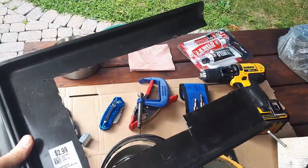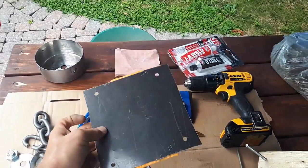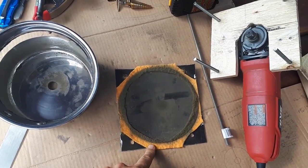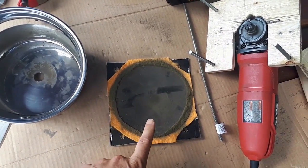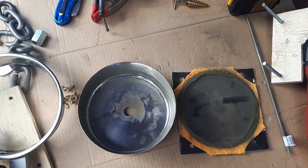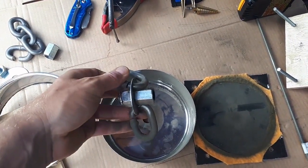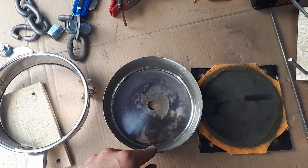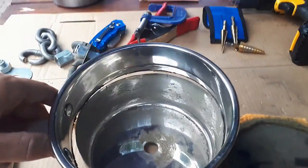You're going to need a baking sheet — I just picked one up used at a thrift store for three bucks. This is what you're going to cut your end piece from, to basically put the lid on your crusher, and it's also about six and a half by six and a half inches. You'll need something to prevent dust from sneaking out the sides — I used a chamois cloth cut to fit and glued on with gorilla glue. A big rubber gasket, homemade rubber gasket, or even silicone would work too. The hardest component to find was the housing itself — to make the six-inch housing for the crusher you need something about six inches internal diameter. Ideally a piece of six-inch steel pipe with quarter-inch or eighth-inch thick walls.